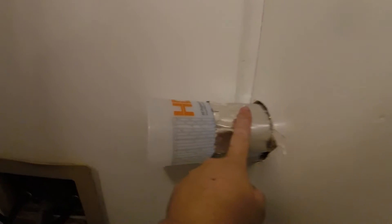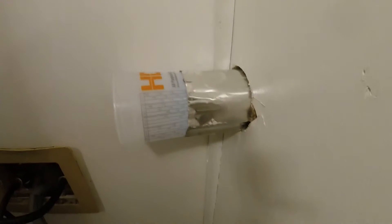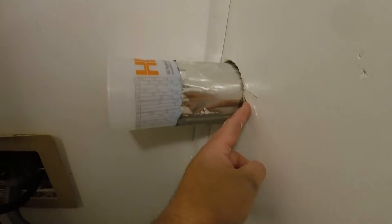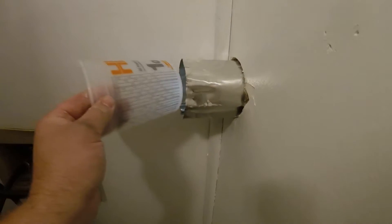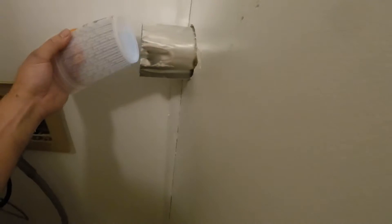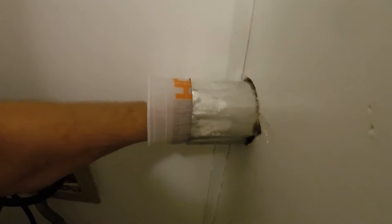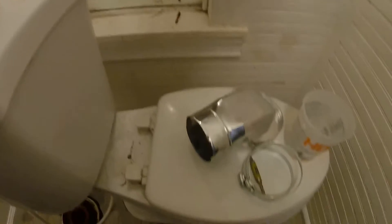We got our new vent installed on the outside. This opening is not perfectly square — apparently they installed the crown molding afterwards or something. We did crack a little bit of drywall, which I'll patch with spackle and caulk later. Here's a useful tip: we bent up this pipe just a little bit. If you take one-quart paint buckets — you can get them at any home improvement or paint store — work them down in, take your fist and stick it in there, and just kind of work it around. That'll work out a lot of your dents and make the pipe mostly round again, so your clamp will have something effective to clamp to.